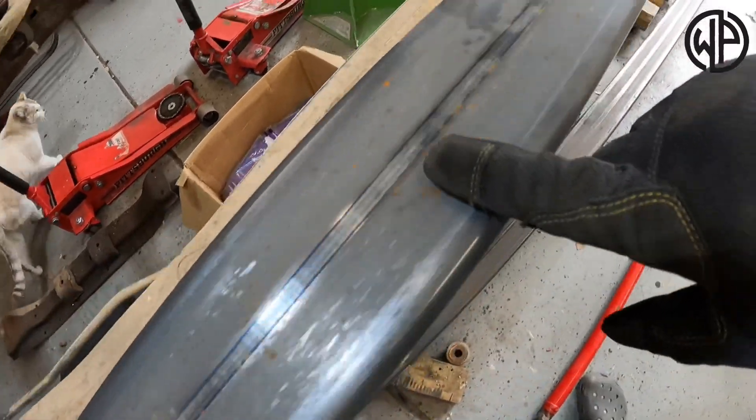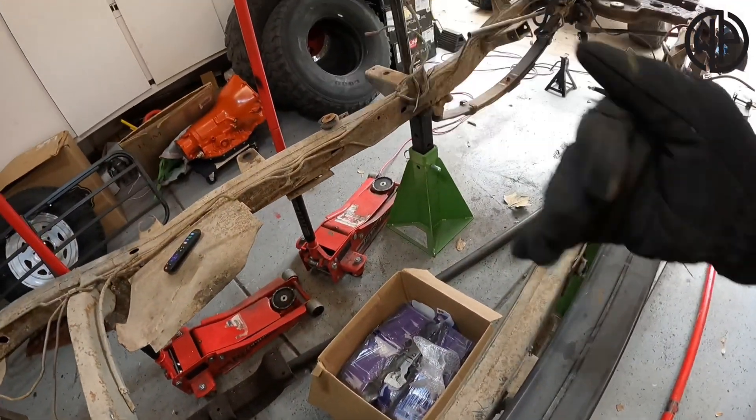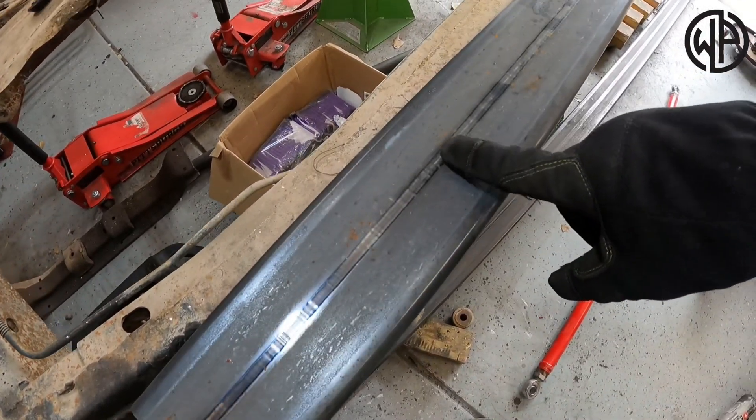You'll see here there is a seam on this tube. All tubing is going to have a seam on it, except for DOM. DOM is drawn over mandrel — that's why it does not have a seam. If you ever buy DOM tube, I would encourage you to run your finger around the inside of it to make sure they are in fact selling you DOM tube, because that seam on round tube is often pretty well hidden. But on this, just to make it aesthetically pleasing and to make sure I know exactly how I'm going to measure, I'm going to have this seam face the inside of the frame on both sides. That'll help me determine which side is the left and which is the right before I actually make cross members and weld the two sides together.